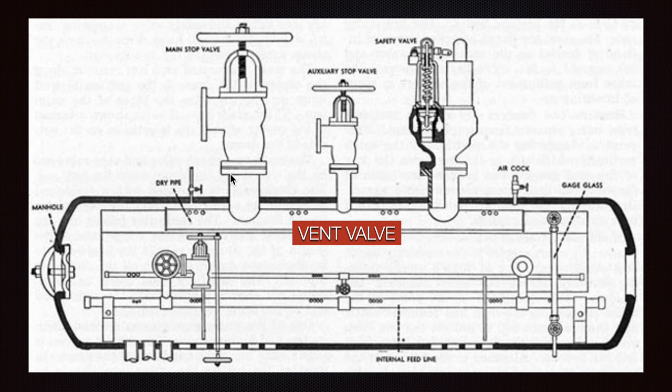There can be some auxiliary stop valves and also bypass valves between the main line and the main steam valve, so you can preheat the line before opening the main steam valve. As I mentioned, most of the problems we get come from the sudden increase of temperature and pressure through the line — it is stressful. The lines are not hot enough, and later on we can have damage on the gasket, the structure, the valves, or the piping.